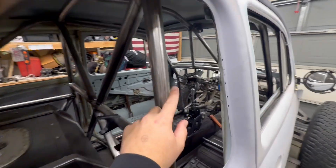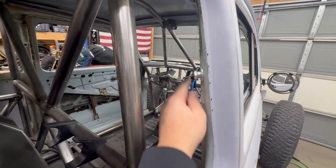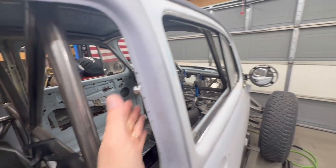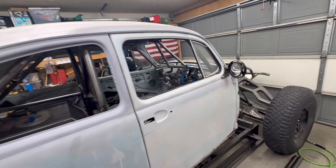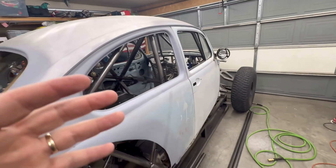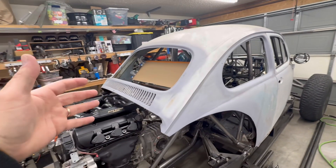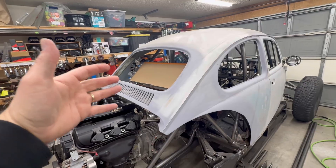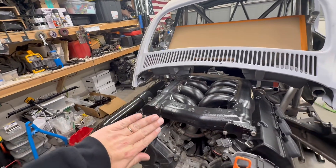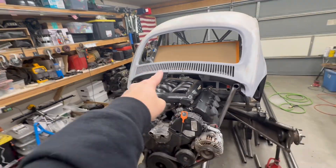I'll also add something from here to the original seatbelt bracket. I already have bolt holes there and I know these are really strong. Then I'm just going to add tabs wherever I feel like it needs it. So this video is kind of just going to be attaching the cage to the body in order to prep to put in my intercooler, and I have to clearance some of this body out right here. Maybe the next video I'll be putting in the intercooler. All right, let's do it.